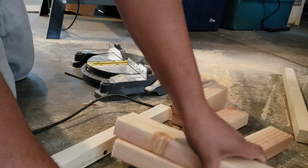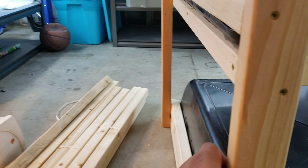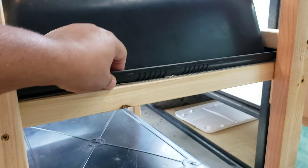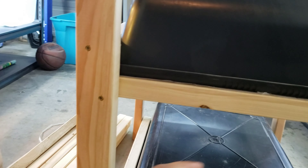Now I'm going to show you the measurements on these frames. This is one side and this is the other side — this side right here is 21 inches, and then this one is 36 and a half inches from front to back. For the two by fours, these ones are mounted directly to the back sideways, so that the bin when it slides has a natural stop. On the front I put it on the side and mount it the opposite way so I can pull the tray all the way out. I'm gonna go ahead and cut two pieces.